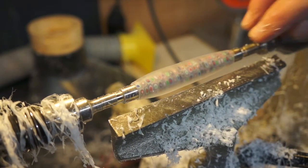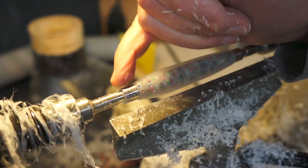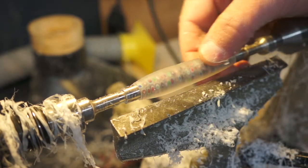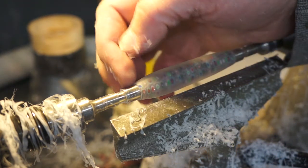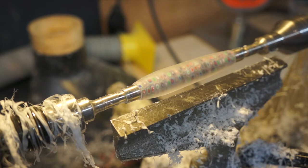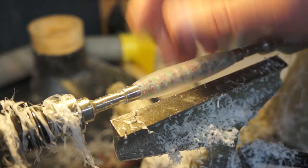I just want to explain — the bushings I'm using here are for another kit, for a pen kit. These bushings are something like 10.1mm in diameter, and the size I've got to go down to at the ends on this blank is 9.2mm. So these are about 1mm bigger than the actual size I need, which is good. I'm going to go down to these bushings, and then I like to measure with callipers, and slowly take it down that extra millimetre, measuring each time.